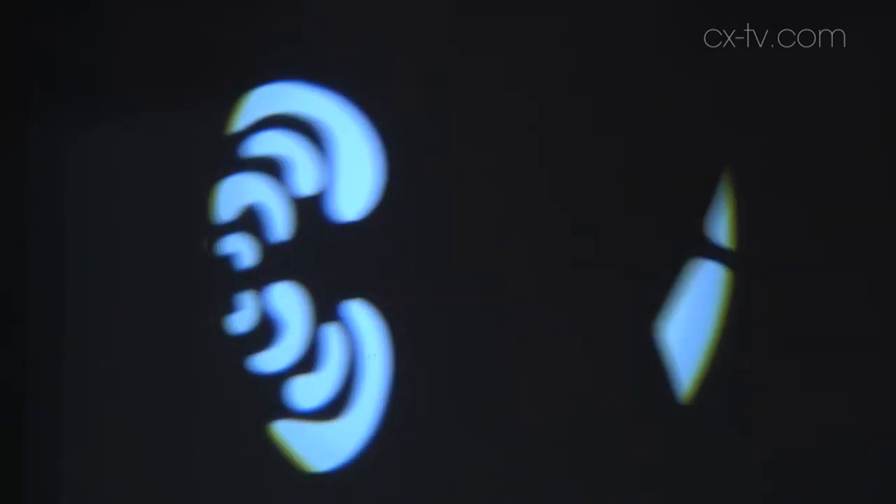Manual focus, 18 watt LED engine with a white LED source, so colour is via an eight position colour wheel. There's also an eight position fixed gobo wheel — you can't rotate the gobos individually, but you can rotate both wheels and stop between positions on both. You can focus it, so it's good to light a mirror ball with. Set it at the right distance in your installation and it would be an excellent fixture for that purpose.